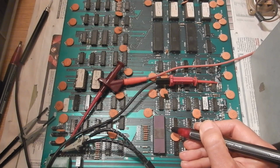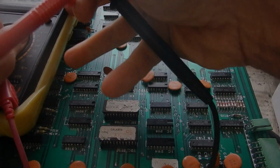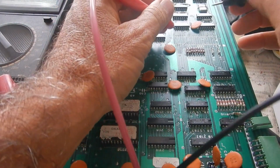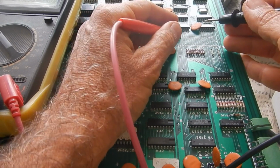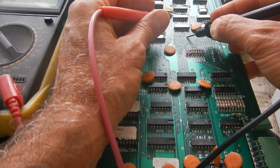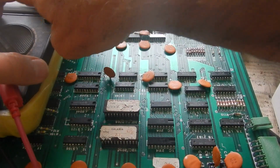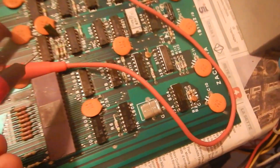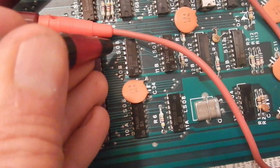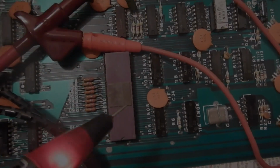However, pin 14 of the CPU shows a pulsing signal. This must be a bad socket. So I removed the CPU socket. And pin 14 shows continuity to U10B pin 10. That's good. Unfortunately, the CPU seems still stuck. All address bus inputs, however, look correct now.